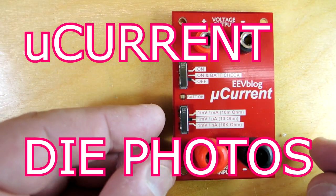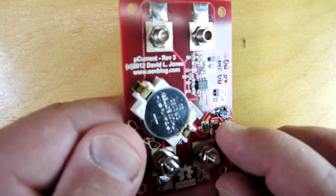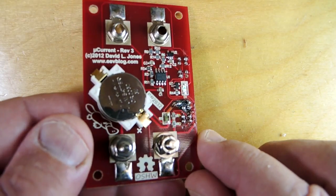This is a test of the measurement kit that converts a current reading to a voltage — a very handy gadget. Unfortunately I managed to destroy mine. I put too much current through it and melted some of the traces on the circuit board. I did a bit of repair but unfortunately haven't been able to revive it, so this module is dead.